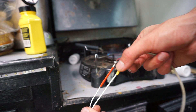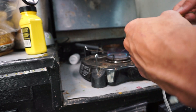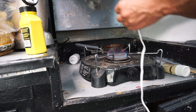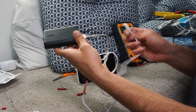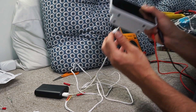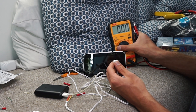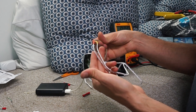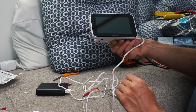The next step is to put heat shrink over each wire so it covers the solder connection entirely. Stick it over a flame for just a couple of seconds and it shrinks down. Ideally, plug it into the power supply and check the polarity and voltage before plugging it into the device — that is very important. For me, the plug is too tiny to get a reading, so I double-checked the wires — the marked lines mean positive and it's going to positive. Now the moment of truth: I plug it in to the appliance, and it turns on. I did it right.